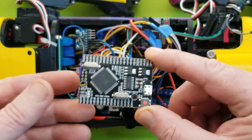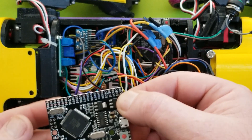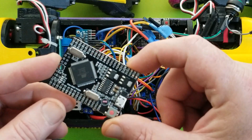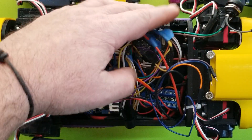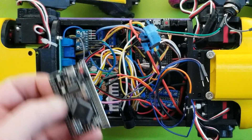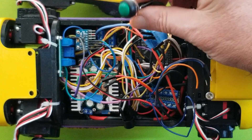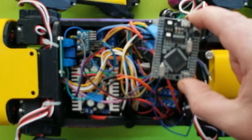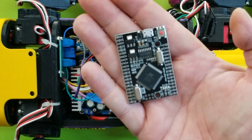This is the first piece — the brains of it all. This is a Mega Pro CH340, which is the ATmega 2560, so it's basically a small version of the Arduino Mega. It fits in there really nicely and is positioned so I can access the USB and the reset button. I did plan to create a button in the plastic shell for the reset, but I changed my mind and I'm doing a hardware button installed on her side for quicker access.